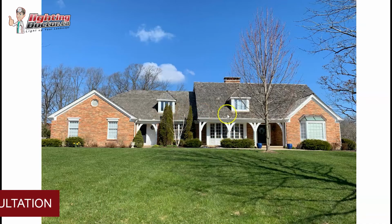And then I would have my 3 uplights at least on these 3 pillars for sure. The nice thing is with the nice white soffits and everything, when that light hits up top there, it's almost like you have soffit lighting, and it really does a nice job of lighting the archways, as well as gives you some reflective light down below. So again, you don't need as many path lights. If you were to put a path light here, a path light here, maybe you throw one on both sides of this tree, and then 2 over here in between where you have those lit. And then you can also get an accent light on this one here too, so you have that consistent balance.